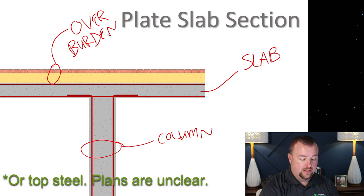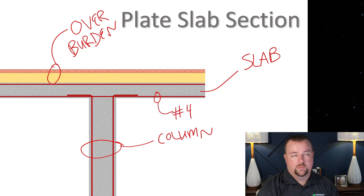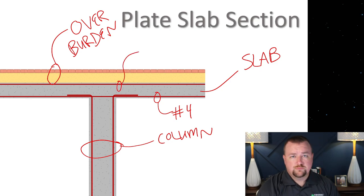The reinforcement for the columns at the pool deck area is a little difficult to find. For example's sake, I just drew it with four pieces because we know from the photos that there were four rebar coming up from the column into the slab. Those rebar would have generally been bent over and lapped — we call that lapping — with the bottom steel. The drawings specify that the building was to have a mat of bottom steel, number four bars, some 12 inches on center, some 13 inches on center. And then you have an upper mat of rebar.